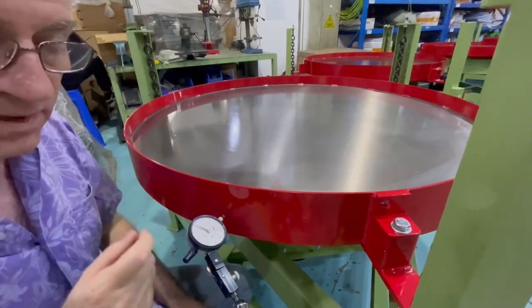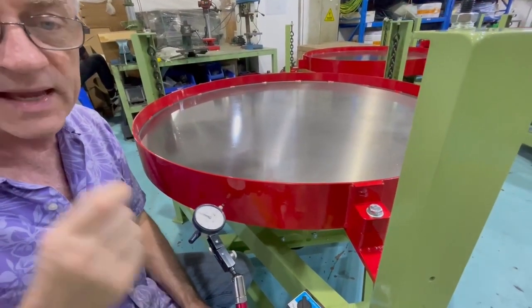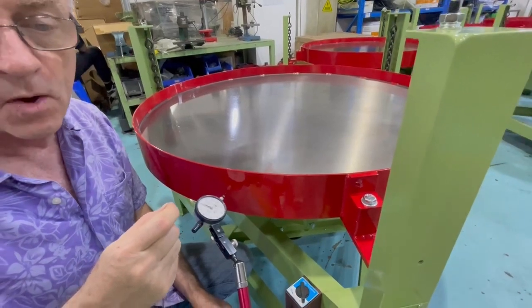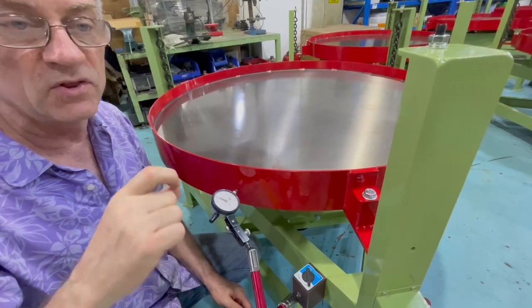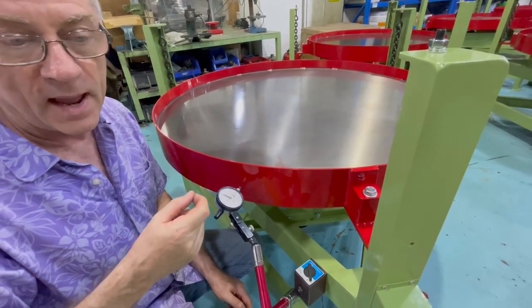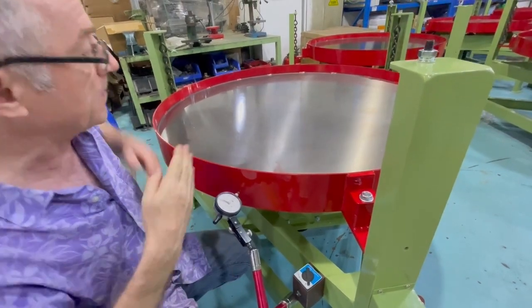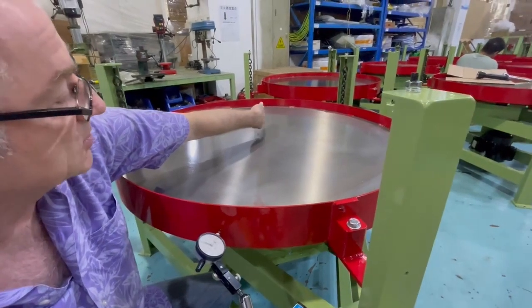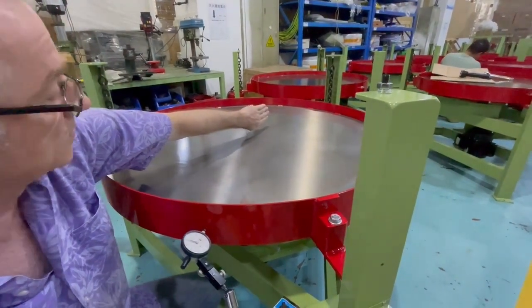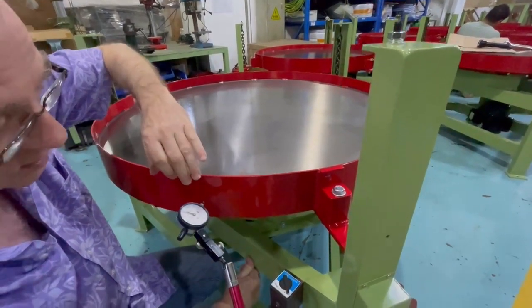What I've found is some people that are having problems, either their set screws came loose on their counterweight, or when they tighten the counterweight up, they got the set screw a little off center and it will tighten. And what will happen is the counterweight will be over here, because it doesn't take much to get 10 degrees off on the set screw.